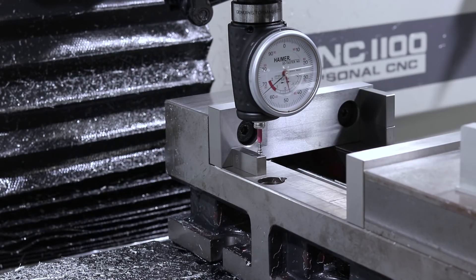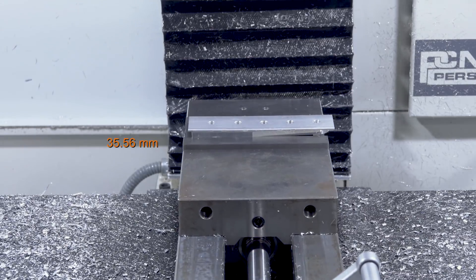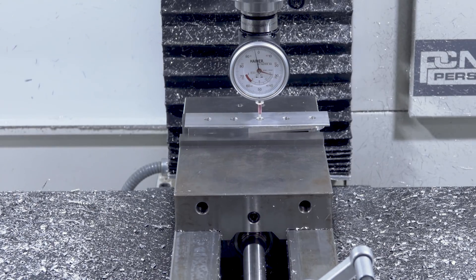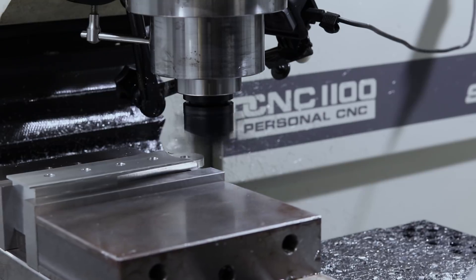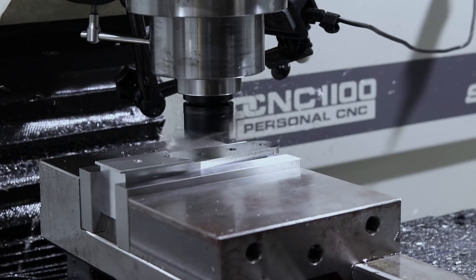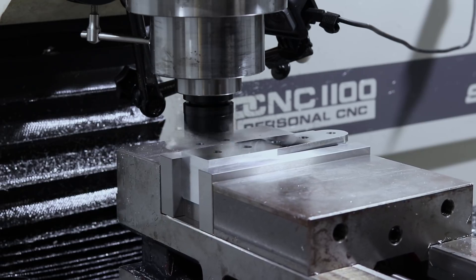Done with op 1 — flip it over. We're using a gauge block and zeroing off of it with our Haimer. Once we find that zero point, we know the part is 1.4 inches tall, so in PathPilot we set the top of the gauge block to negative 1.4 inches. Then we locate off the center of the hole for X and Y, giving us a very accurate way to have flipped the part for the second operation. One thing to note: we usually won't use the Superfly to make a face cut like this unless there's very little overhanging material — too much overhang and you'll curl the material up and tear it out of the vise.